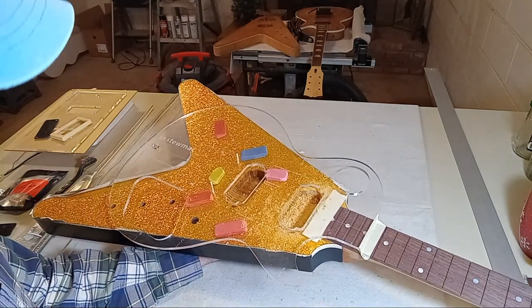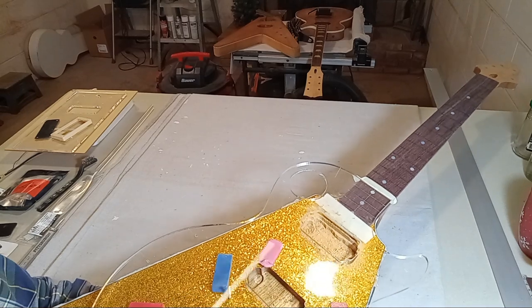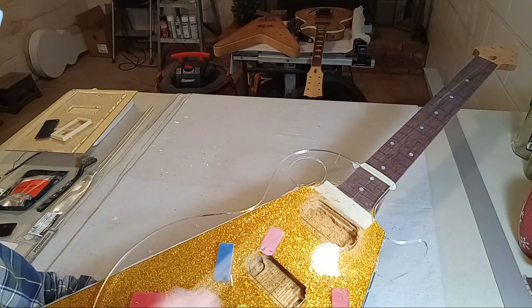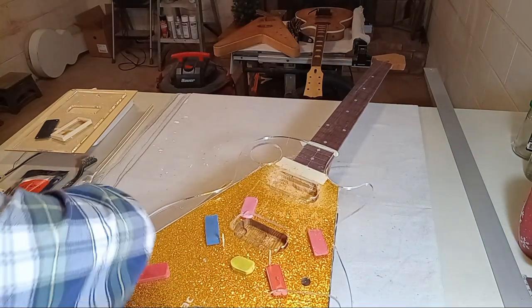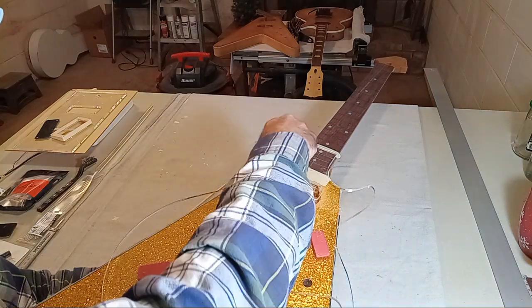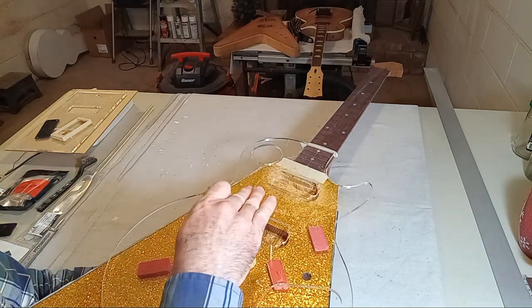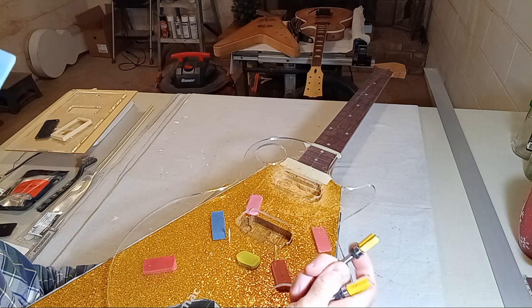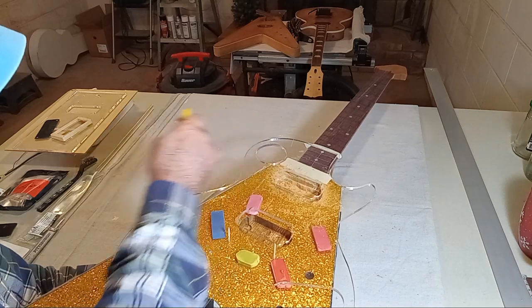All I'm doing is coming in with very shallow passes and redefining the opening. I came in and drilled it all out rough, but really take your time — don't try to route the bit in one step. The bit chucked up in the drill press is only about 5/16" tall, very short. What you see here represents three different passes: first pass was about 1/8" deep, second pass close to a quarter inch, and the third pass was defined by the actual bearing getting low on the template thickness.